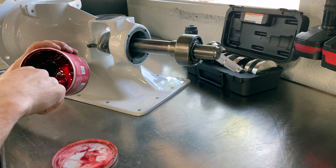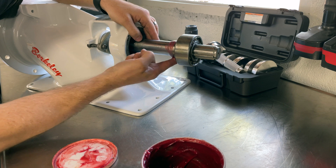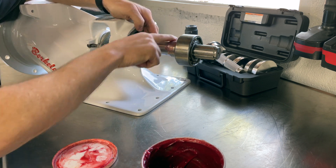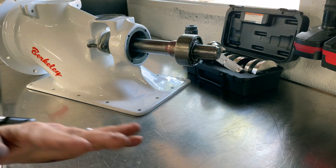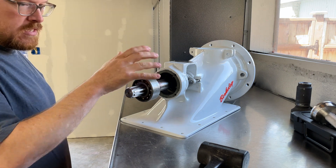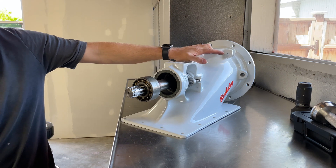I'm going to put a little bit of grease to help lubricate the shaft as it goes into the forward suction housing seal — or rear, depending on your orientation to the boat — and we'll drive that in. I need to get the shaft driven all the way in to seat this bearing into the suction housing, so I'm just using a standard dead blow.